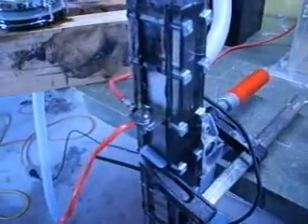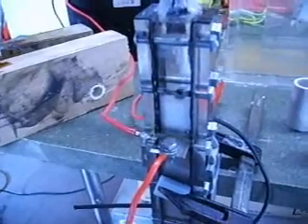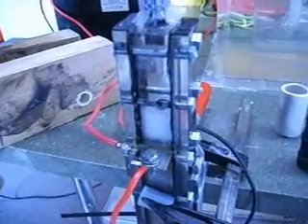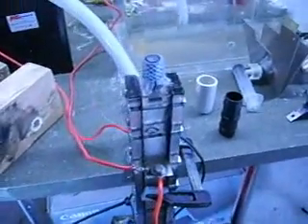Obviously, the idea is to try and minimise the amount of electrolyte you have in your water, so that is one of the downsides of neutral plates. But at the end of the day, they do produce more gas — I have no doubt about that at all. On my new design, I think I'm probably going to end up using about four neutral plates, but I'll talk about that more in a second.